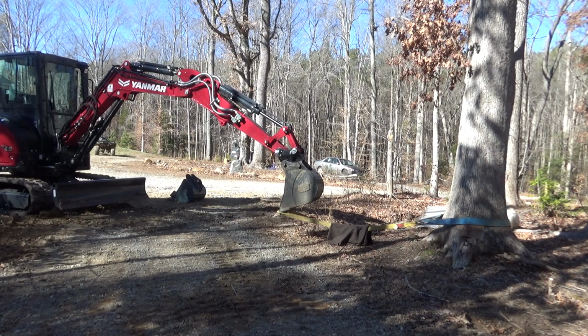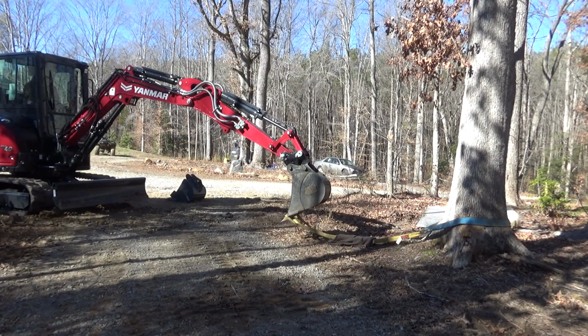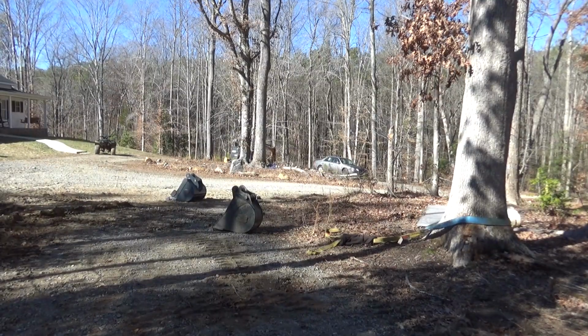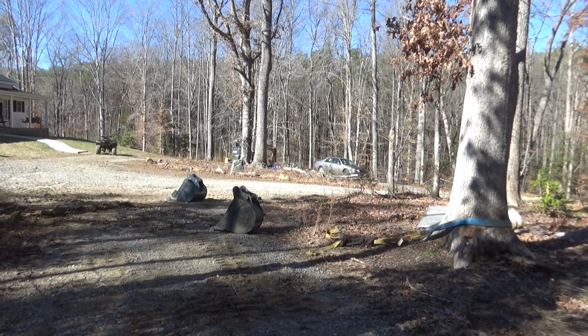And talking about the arm, might as well go ahead and see what the arm force is. So I'm just going to pull with the arm this time and see what that number comes out to. All right, so the arm did 5,300. I mean, consistently, it was right at 5,300 and then it pegged, which I believe is actually more than the spec sheet. I'll pull the spec sheet out later on and we'll take a look at that.